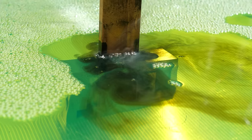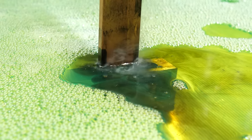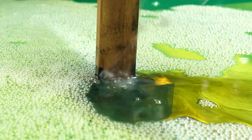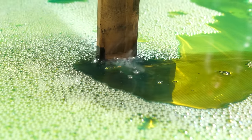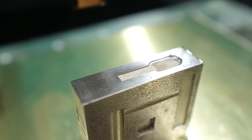The liquid is also a better heat sink than air, keeping the bulk of the part cool to prevent expansion. Why does an electrical spark erode a contact point? Interestingly, we don't know for sure. One possible explanation is heat — when there's a spark, a huge amount of electrical energy is converted into heat energy in a very short period of time. The metal gets very hot very briefly, and some of those metal atoms will vaporize away from the surface. So if you want to etch away at something, this is the tool for you. But if you want to slice through something, you need a different tool — that's where wire EDM comes in.